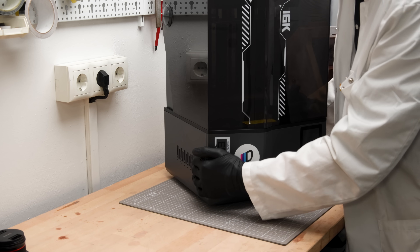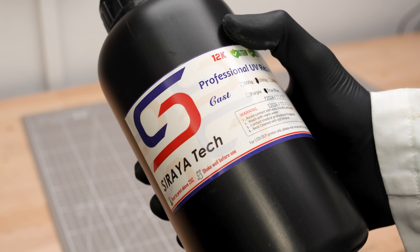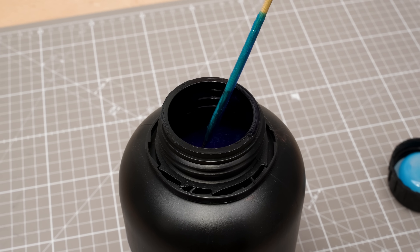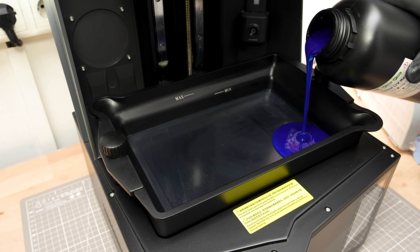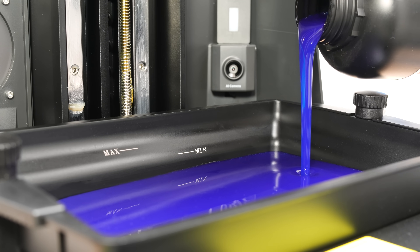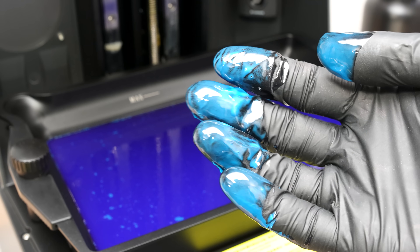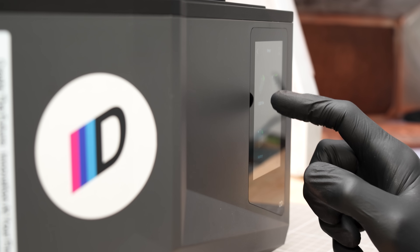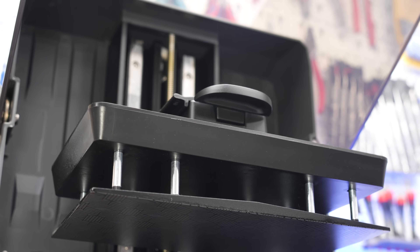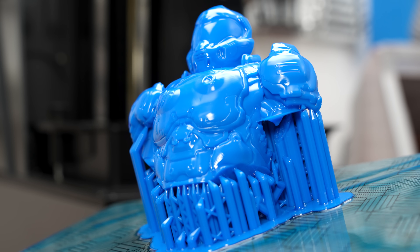Over on the resin side of the lab I'm firing up my beloved Saturn 4 and loading it with casting resin. In theory you should be able to just burn it out clean. I put it in and did a quick exposure test straight on a nitrile glove. Once it cures, it turns deep blue and feels almost like wax. I learned fast that these prints need seriously chunky supports and that the material itself is pretty brittle, but I kinda expected that.